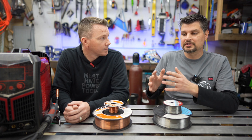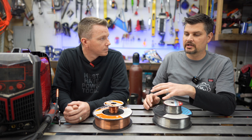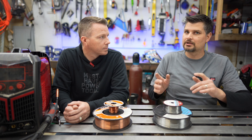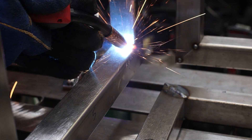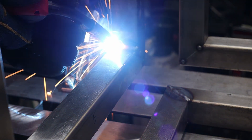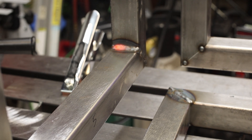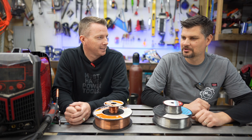Number three advantage would be that you can do thinner material with MIG welding. This is where it's great for auto body — those panels where you've got some thin sheet metal. Combine that with the quick, easy cleanup and that's where you just use MIG welding. If you've tried thinner gauge square tubing with flux core, you tend to burn through it every time. MIG is going to be a lot more forgiving in that scenario. When you go to restore your car, use MIG for those panels.